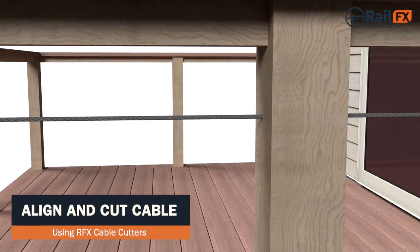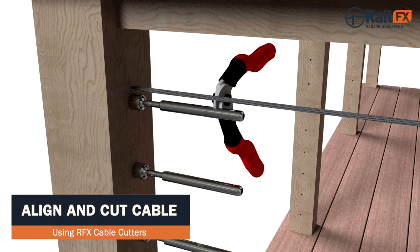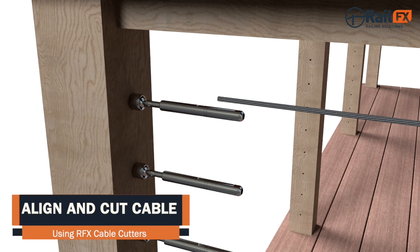Go to the other end of the cable and pull the cable tight. Align the cable with the cut mark on the tensioning end fitting. Mark the cable and cut with RailFX cable cutters.